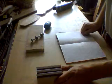Don't risk your hands near the blade, which is turning on such machines. But I think such a little piece of wood, which is not extremely hard wood, just tropical wood, quite soft, it's also possible to do by hand. What we are going to do now is plane both sides here, as they are still not square and far from ready. Then, when it's done, it will be glued and screwed from the bottom with 4 screws.